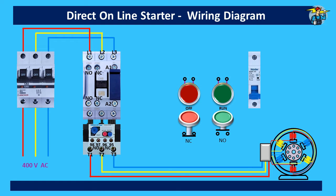A red indicator lamp shows the motor is at off position. If the motor stops from thermal overload activation, there is a yellow or standard amber color indicator lamp to show the motor is at fault. Some have confusion about the motor run and motor off indication lamp colors, but the standard colors given in electricity guides are green and red for run and off positions respectively. On many starters, the indicator lamps for start and stop are on the push buttons itself.